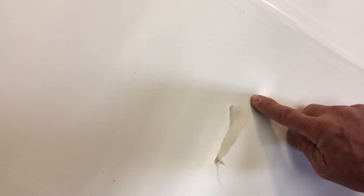Before you start sanding, take your hand and mash down — there may be something under there that wasn't at the surface that needed a piece of tape. You may rub across and feel the rear spar right there. If you get the DA out of hand, all it takes is passing across that one time and you will actually cut completely through the fabric. I like to just mark those spots with little pieces of tape as a reminder when you start sanding, then take them off one at a time and hand sand those sections.